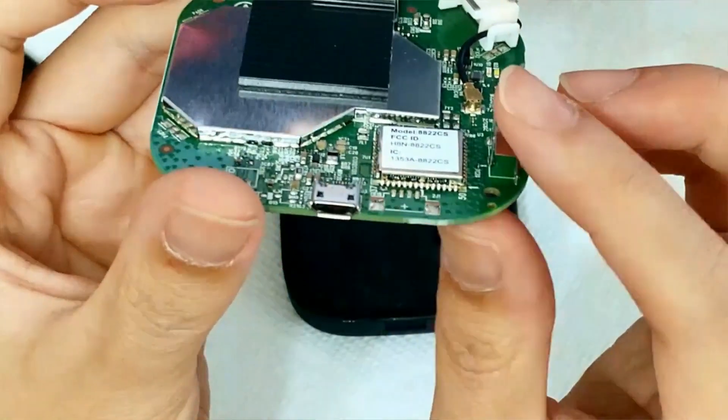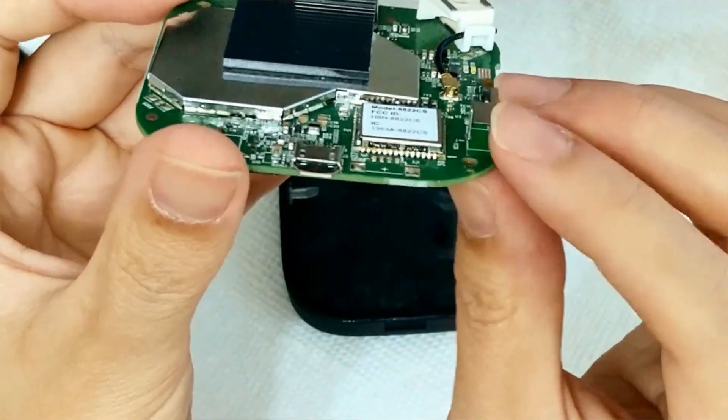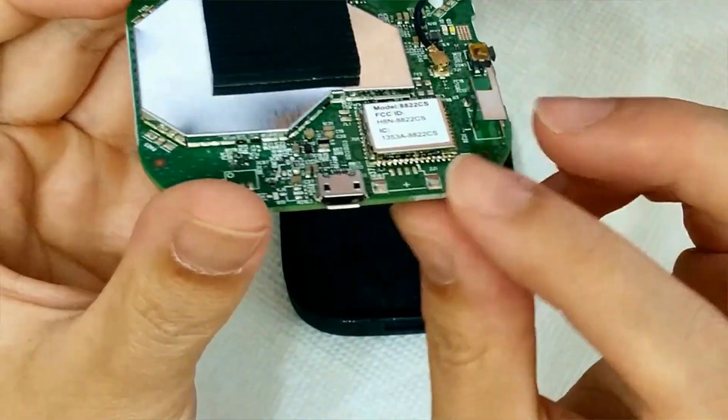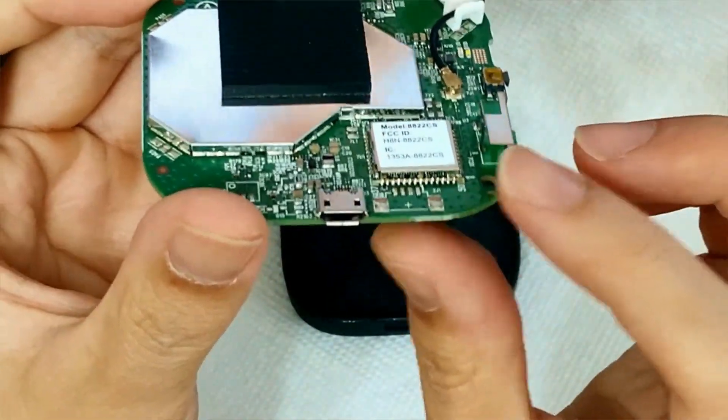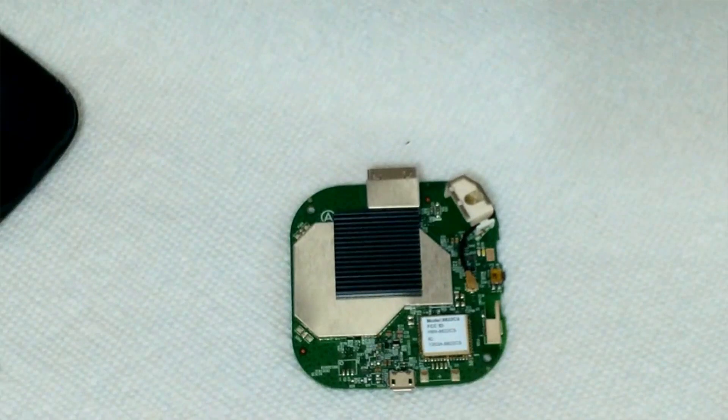What I'm going to do is actually turn up the heat to about 450 degrees and just hold the soldering iron near it so that it just warms up the solder and loosens it a little bit. So I'm just going to hold it very close and not even touch it.